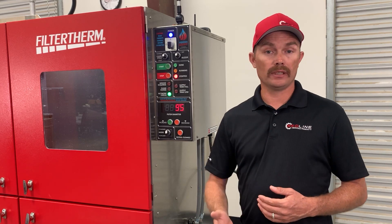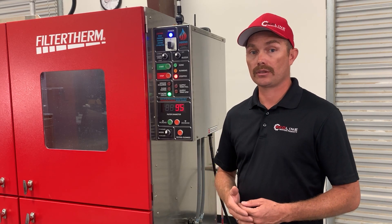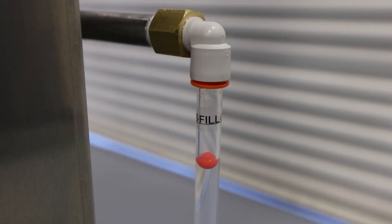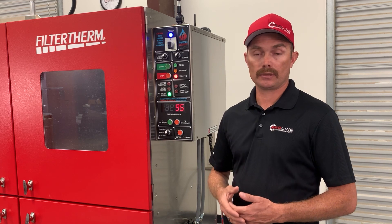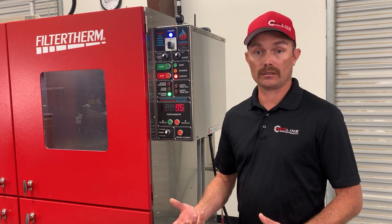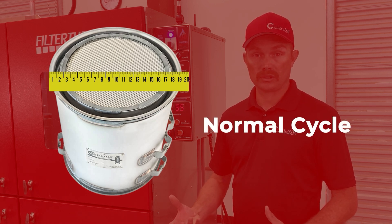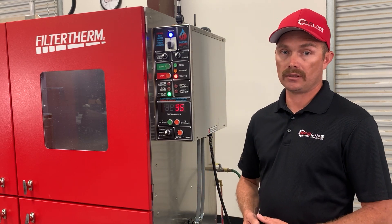On this side we have the supply tank full indicator and the supply tank low indicator. Every DPF that gets pulled out of the machine loses about one to two gallons of water, so over time there will be a reduction in water. We want to monitor how much water is being removed via the water level indicator on the clean tank, which is located at the back of the machine. Below that, we have the filter diameter screen. The machine can handle filters ranging from 5 inches up to 20 inches in diameter. You can increase or decrease the diameter by pushing the green button to increase and the red button to decrease.